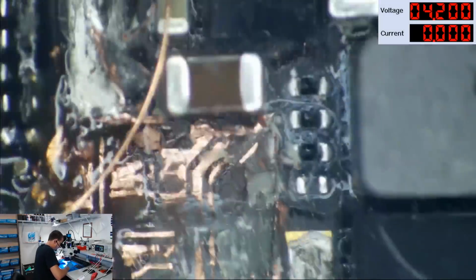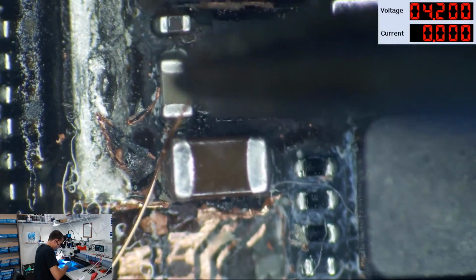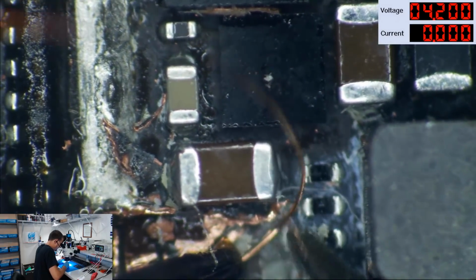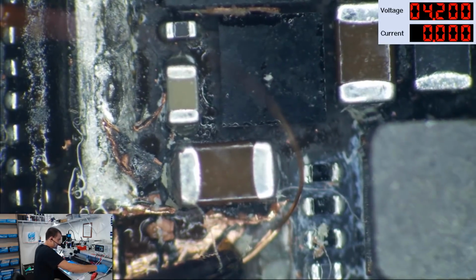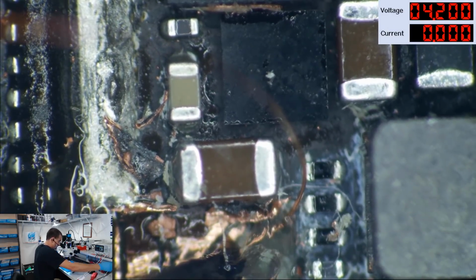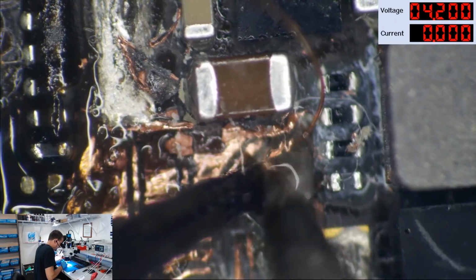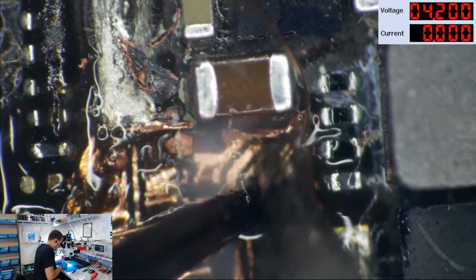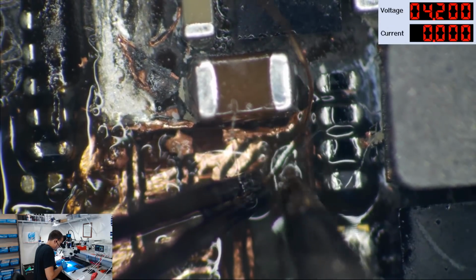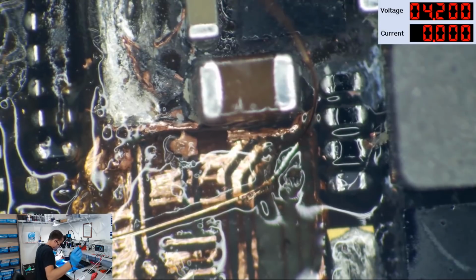Now we're going to take our little crazy small wire here. All right, we're going to solder it right there. So let's get some flux over there. Be sure and blob solder everywhere like I just did on the first side of this wire. All right, we're going to tin up the wire, tin up the trace, and we're going to nudge it right on over there like that. All right, so now we have an LCM reset connection here. Right? A lucky one.